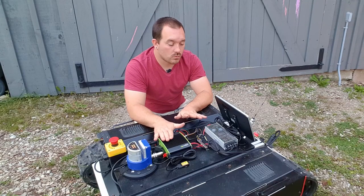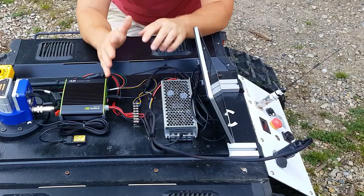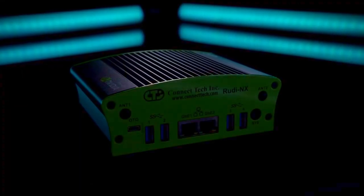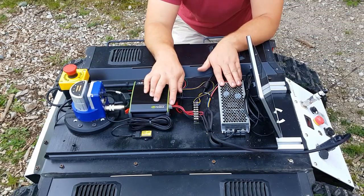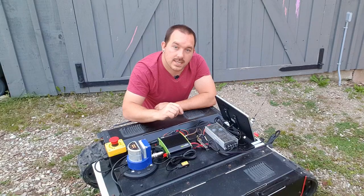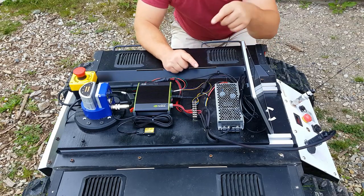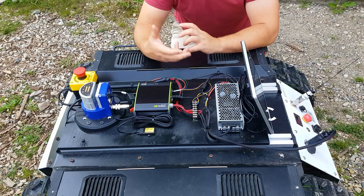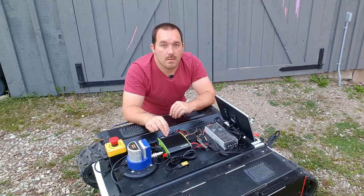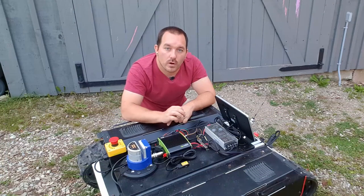To run all of this, we have all the hardware on top of the robot. First, we take power from the battery up into a voltage converter that takes the battery voltage and makes it a nice steady 24 volts. From there, that goes into our Jetson — this is the Rudy NX from Connect Tech, which has a nice wide voltage range so it's really flexible. It also has CAN, which is an industrial protocol that cars use to communicate with devices. We use CAN to talk to the robot, send commands, and get feedback. This has all the processing we need to control the arm and the base, and it also has CUDA cores specifically meant for running AI and machine vision — all perfect for our application.